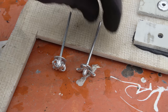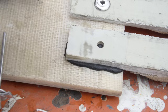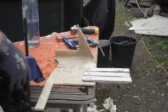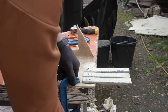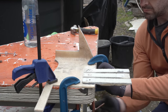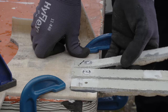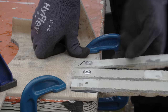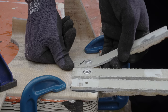A third option is to use 3M's 5200 adhesive, famed for its mighty strength bonding fiberglass to more fiberglass. It's going to be a peel test, and this is pretty brutal. The best performance and PSI stats from fixing and adhesive manufacturers tend to quote for shear strength instead. First, I lift up the strip held down by the peel rivet, and immediately regret not using much thicker fiberglass. The rivet holds firm, and the fiberglass fails.